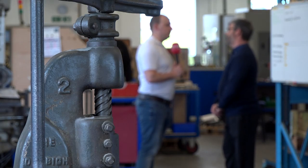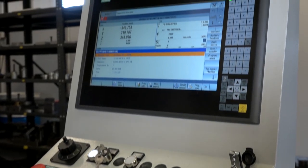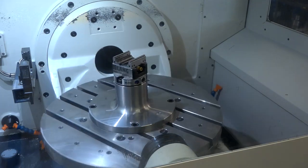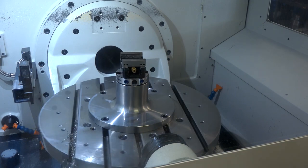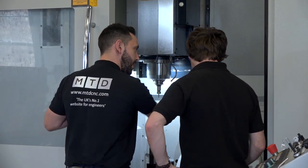When you were selecting the machine, you were thinking about a horizontal machining centre as opposed to vertical. Why did the vertical 5-axis win? It's a similar technology to what we've got — we use VMCs, and horizontals are great for maybe bigger batch quantities but we're typically on the smaller batch size. And you went for the 4-plus-1 as opposed to the full 5-axis — is there a reason for that? Yes, down to cost and down to the type of work we do. 4-plus-1 will cover pretty much 90% of the stuff you would ever need to do on a 5-axis machine.